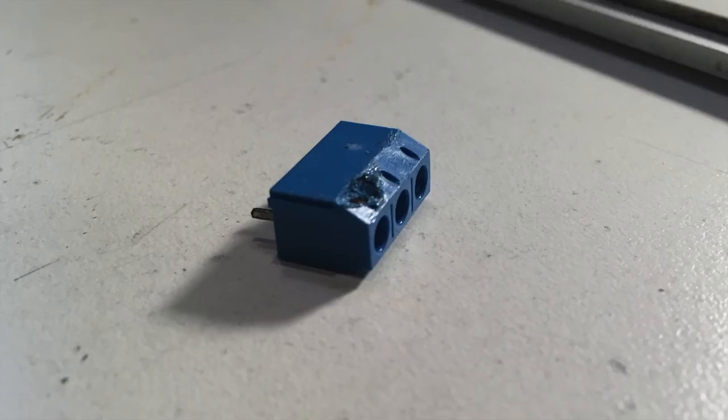A lot of people will just go on forums and see what people recommend and say, 'Oh, this bed heats up really fast, I'm tired of my slow bed, I'm going to plug this into it,' with complete disregard for what the MOSFETs and the connectors can actually do. Even if these manufacturers stick somewhat to the original specifications, there's a chance of bump components, counterfeit components, fabrication errors, things like that. So it's good to go and break down each of those individual parts, especially the important ones — the ones that can go up in smoke.